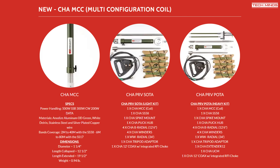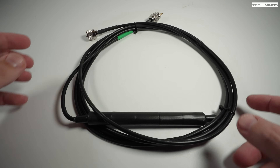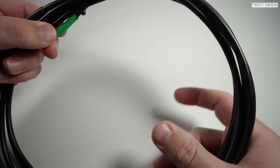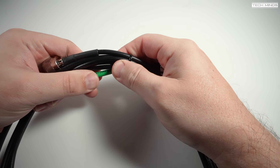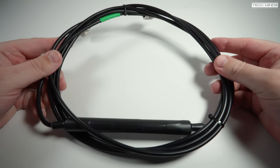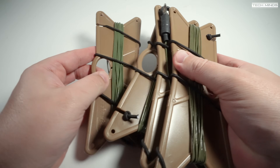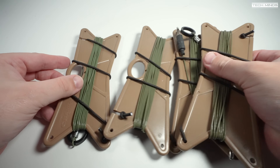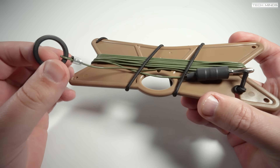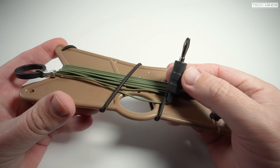Let's take a closer look at what's included in the box. First up is 12 feet of RG58 coax with an integrated RFI choke. The user manual states that this antenna should be used with an inline choke, so it's nice to see this on the included feeder cable. We also get four counterpoise wires pre-wound on plastic winders. Each wire has a length of 12 feet and 6 inches, with an isolated plastic ring on one end and a banana plug on the other.